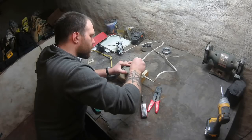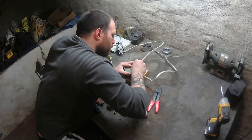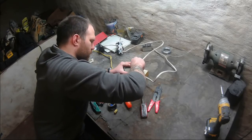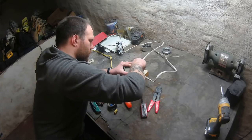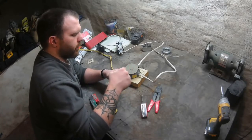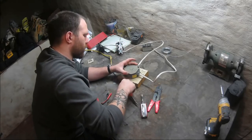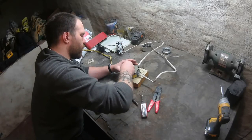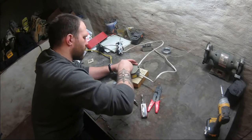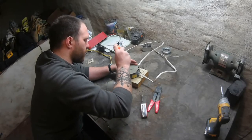From here we're going to complete the box by adding the face plate. Before you put everything in stone, test it out and make sure that all the power's going where it should be working — make sure the outlet's working, if you have two outlets make sure they're both working, make sure you have the light switch working, make sure everything's definitely going according to plan.